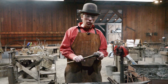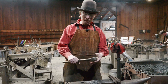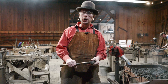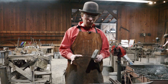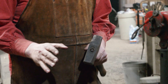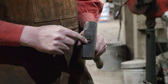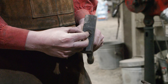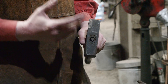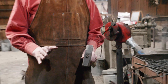The first one is loose hammerheads. This one still feels pretty tight, actually, but if you start seeing some wiggle in your hammerhead, you're going to want to re-handle that and make sure it's safe. The reason we've pulled this one and set it aside in the back of the shop where none of our students can use it is we are actually missing the wedge in it — there is no longer that extra bit of material pushing the wood to the outside of the eye, keeping this hammerhead on securely. This hammer is no longer safe.